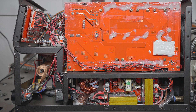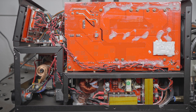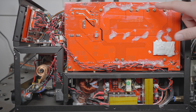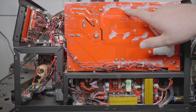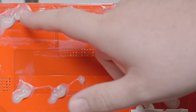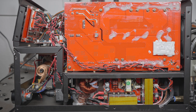Not a whole lot else to note on this side, other than a relay stuffed down and strapped to the air hose, and the fact that while silicone is gooped over the higher voltage terminals, a lot of them are just sticking out straight through it. Overall, nothing stands out as too terrible, but it gives an impression of a bit of a kludged-together design. As long as it works, most won't care too much about what it looks like inside.